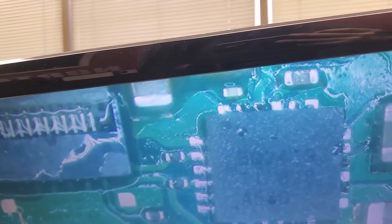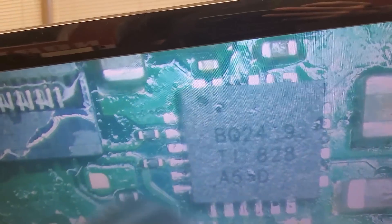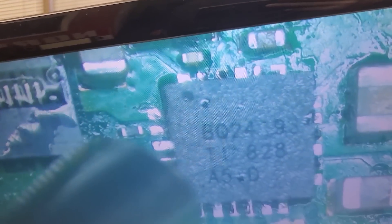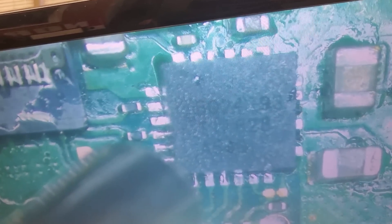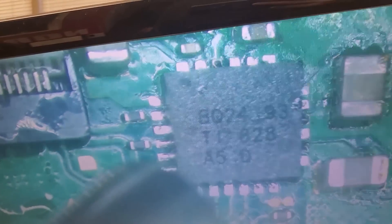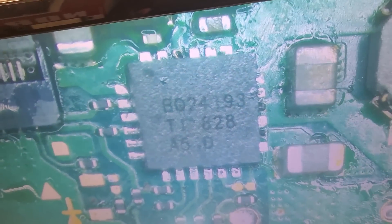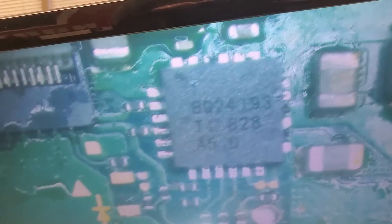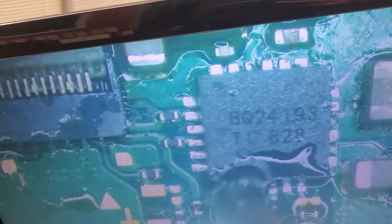You need to push it from the right side a bit. Perfect, perfect. Now what you need to do is add some flux, push down on the chip, apply hot air again, and you're done. Any solder that squeezes out you just remove. And look at that plastic.